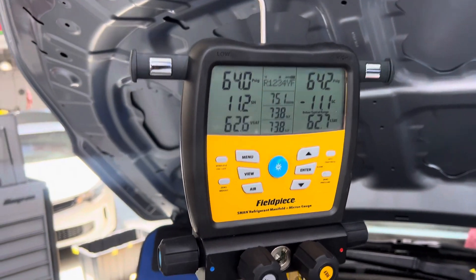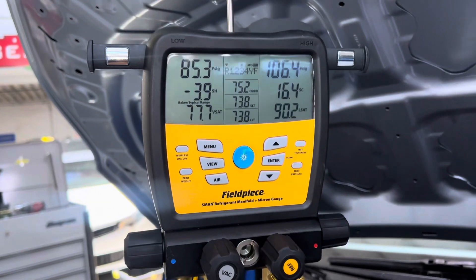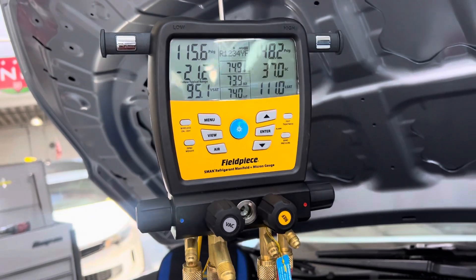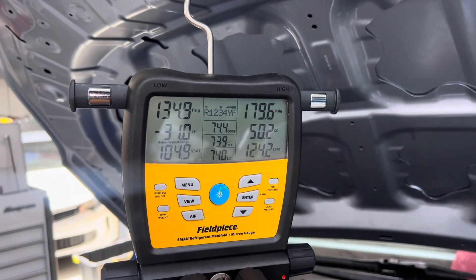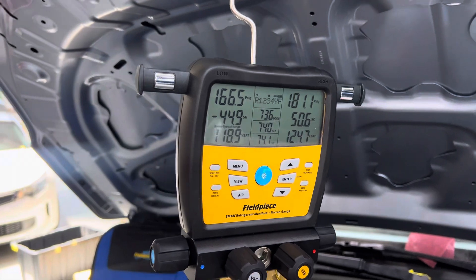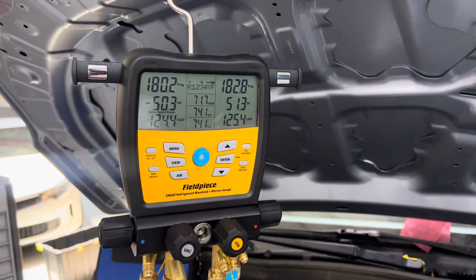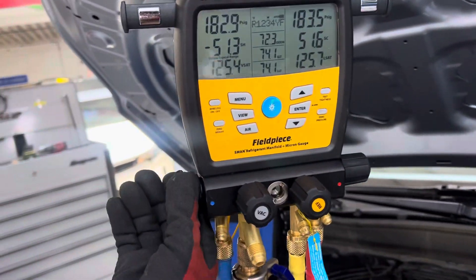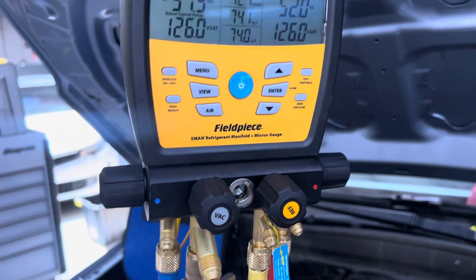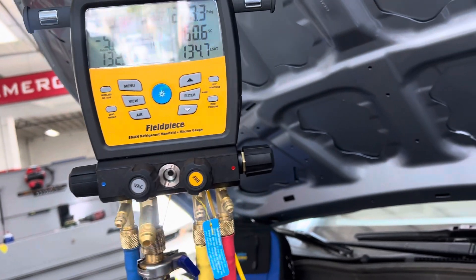Pressure is going up. I'm running low on gas — I can tell that last crank should have sent it higher but it didn't. As you can see, we do not have a hard shut-off expansion valve. It went right from the high side through and all the way to the low side. I exceeded my target a little, so I shut off the nitrogen.